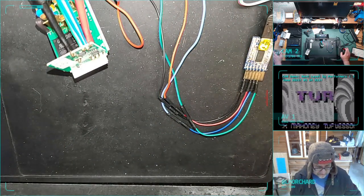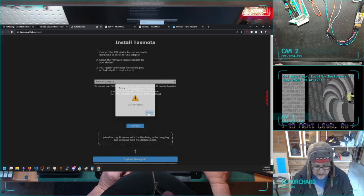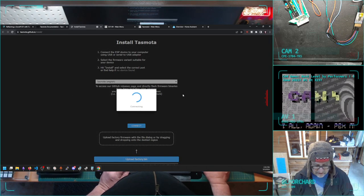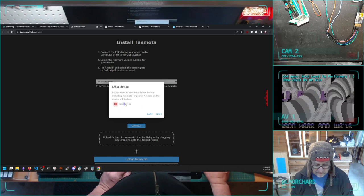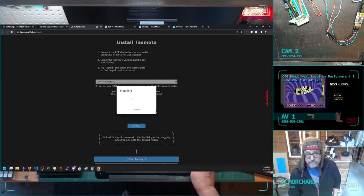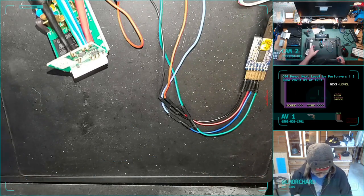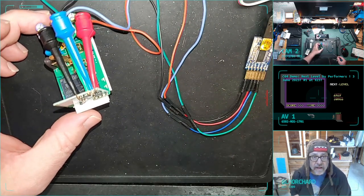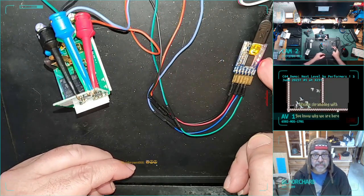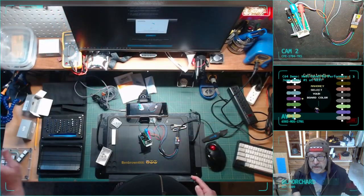So then we can do this again. On port 5, connecting, and it looks like I did the needful. So yeah, I went through it super fast, but the process is: get these pins connected with these probes. Get this little serial widget set up and happy. You can see the red light's going. That means it's transferring data again. And now it's just overwriting the factory firmware.